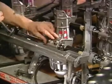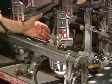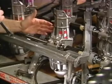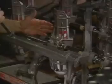By loosening all of these bolts, we could slide the cup slightly lateral in order to put the pins on spot. With lateral movement, we would need to be careful so that we didn't move the cup so far that it might bind or touch the yoke as the cups are turning from the horizontal to the vertical.